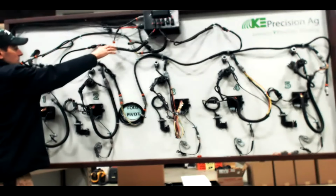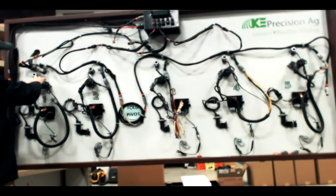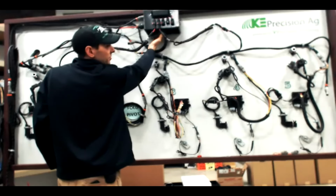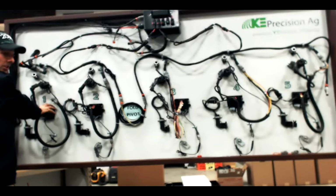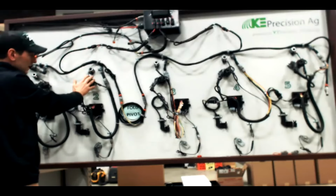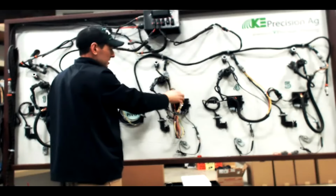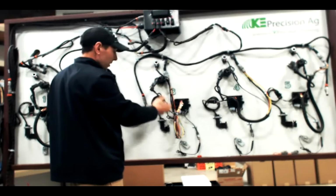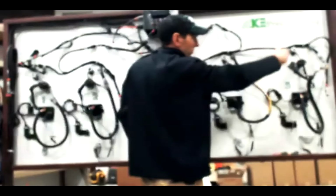The daisy chain is also in sequence, one continuous sequence. First it goes to the PDM. There is an SRM up inside the PDM, and that identifies as the first SRM. Then it comes to row 1, and it sees the SRM there, and the serial number assigns to row 1. It moves to row 2, sees the SRM, the V drive, and the serial numbers, and says, okay, that's the next one, so that's got to be row 2. We move to row 3. Same process. It sees the SRM serial number, the V drive serial number, and whatever other components are plugged in, identifies that as the next row in line, so that must be row 3, row 4, row 5, and so on.